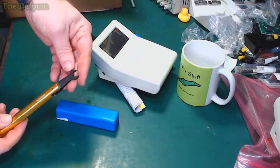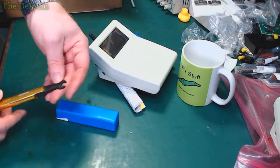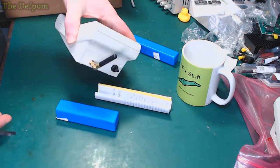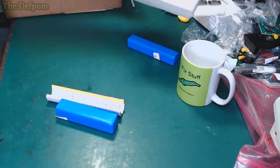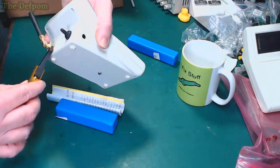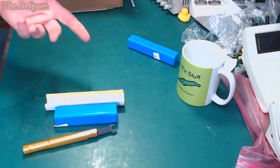I don't know. It wasn't that expensive. I think it was about $20. But I got that because I'm thinking, I keep doing these kinds of connectors and not actually getting them torqued. I'm just sort of doing them where I think they should be. I mean, if you're doing connections, you should really have a consistent torquing method so it's always done the same way. This could also be torqued up like that, and then here we go, just now torqued. So I thought it'd be a good idea to get one.